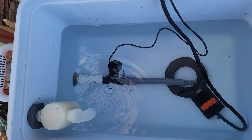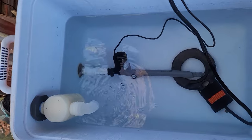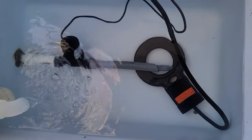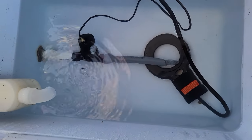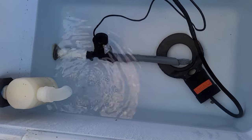One thing you need to do is make sure that the pump is primed — there's no air in it or else it won't run effectively. You also see that I have a little hose with a little screen on the end just to prevent any debris from getting in there, and we clean that really well when we put it up for storage and throughout the year.